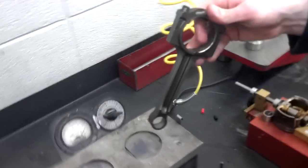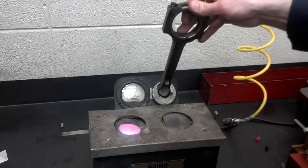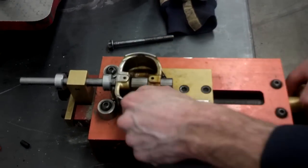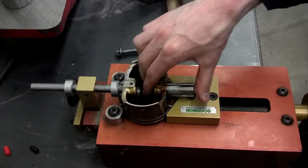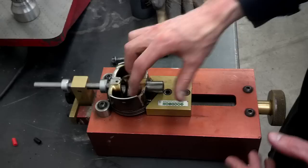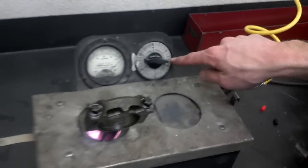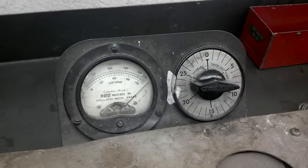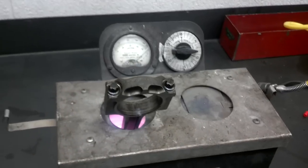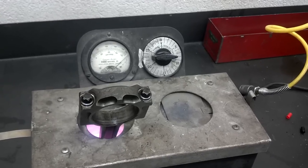Now we'll place the connecting rod in the heater over here, and I want to make sure that I've got the front of the connecting rod facing towards me. I look for the marks that I've made that show this is the front of the connecting rod so that when I put them together, everything is perfect. This whole operation has to be done in about three seconds. We heat up the connecting rod so that it's bigger than the wrist pin — once they're at the same temperature, the wrist pin actually is bigger than the hole in the connecting rod. We watch the timer; you usually leave it in there for two minutes. If you don't leave it in long enough, this won't work. If you leave it in too long, the connecting rod gets red hot and that changes the properties of the metal, and you'd have to throw it away and get a new one.